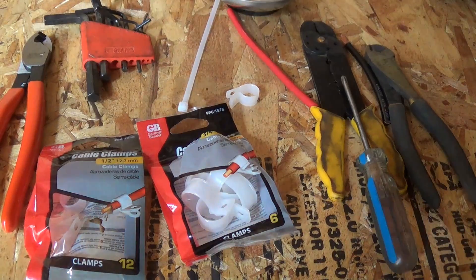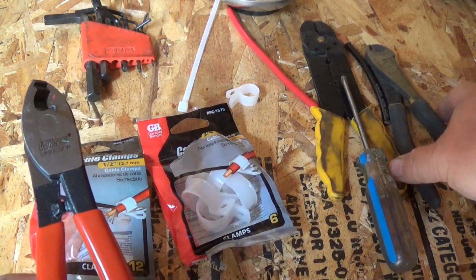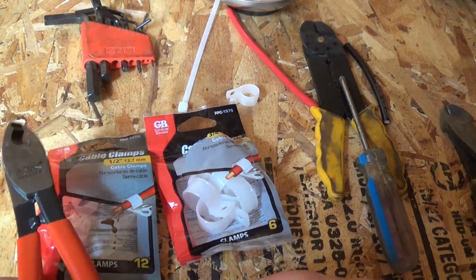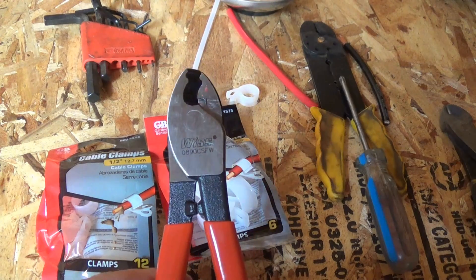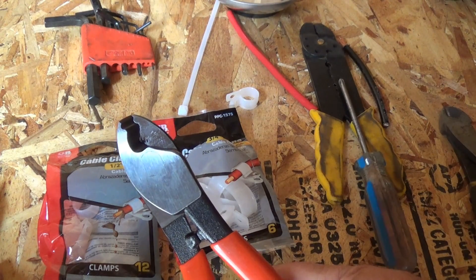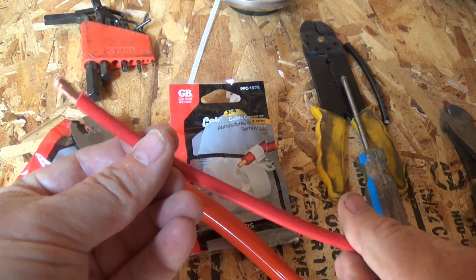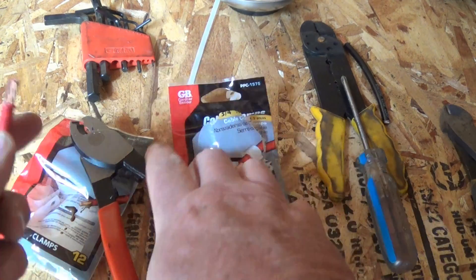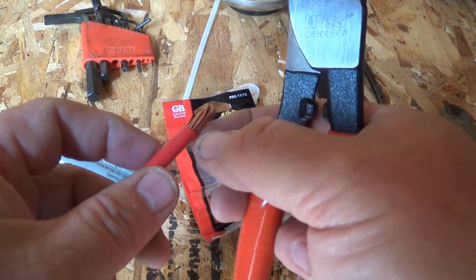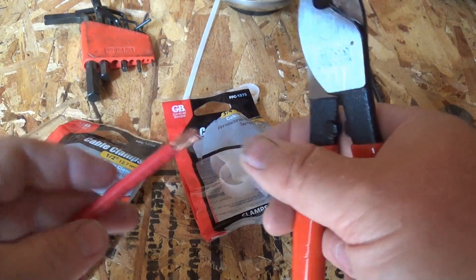Here are the tools I used to get the solar charger all wired up. These cable cutters — I just bought these. I first tried cutting six gauge wire with the smaller ones and what a pain that was. But this larger cutter is a dream — I'm so glad I bought it because I'm running a lot of six gauge wire. I also used it to cut the insulation coating. You don't apply too much pressure so you don't damage the strands, and you can feel when you're through, then just pull it off.